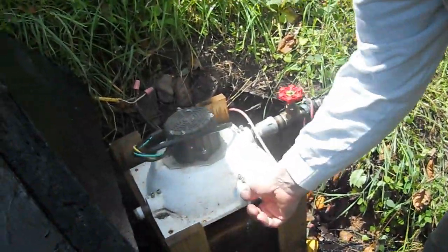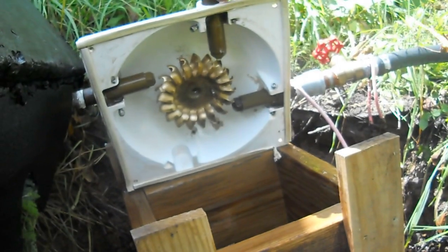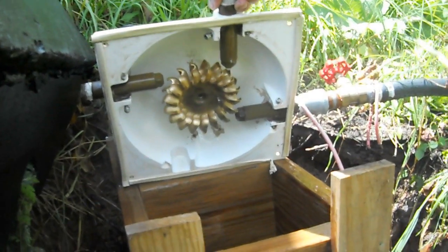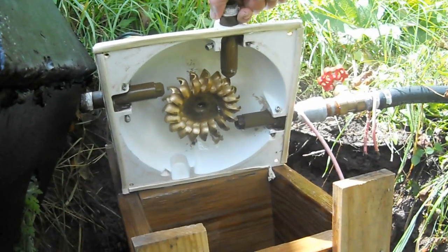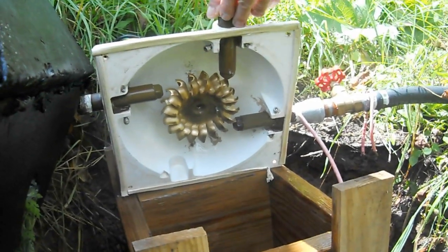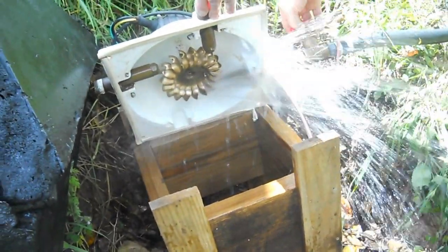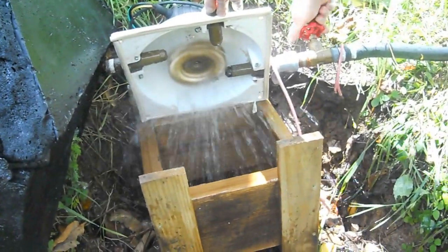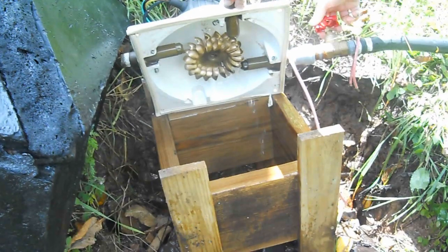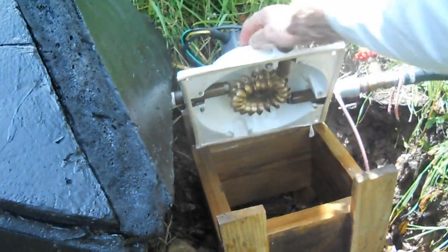This is the — I think it's the 1500 unit. It's a four-inch Pelton, bronze Pelton wheel, which is not at all unusual for this sort of technology. I'll turn it on just so you can see how it will start working. There you go — it starts spraying. The ideal setup is that the water basically just falls straight off the Pelton wheel, so all the energy is transferred to the wheel.